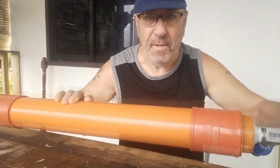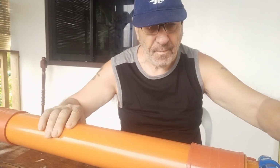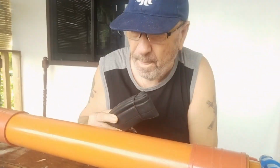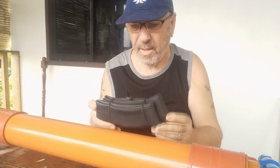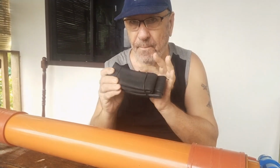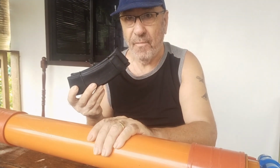after watching a few more videos, I realized that to work out the size of this, this is probably okay. It's 22 inch long, just the pipe itself, but you need to have something that absorbs the shock of the water or the impact of the water. And what about here is far too big. This would have been ideal. Once I pump up, it would have been okay if the volume of this would have been somehow half of the volume of that. But I can't put it in, it's too big.